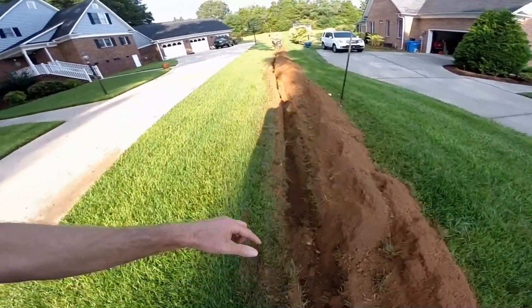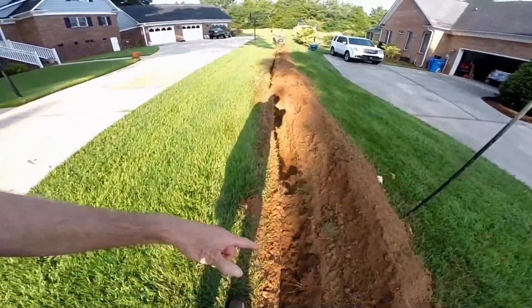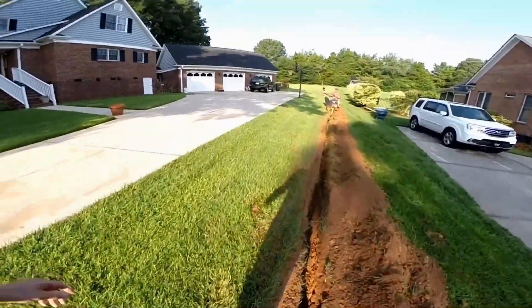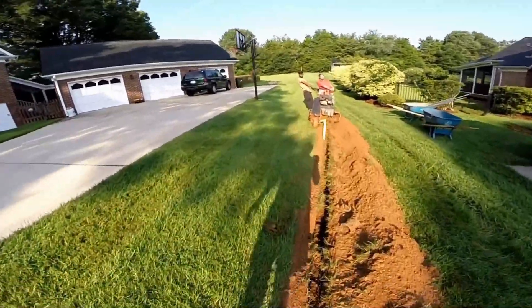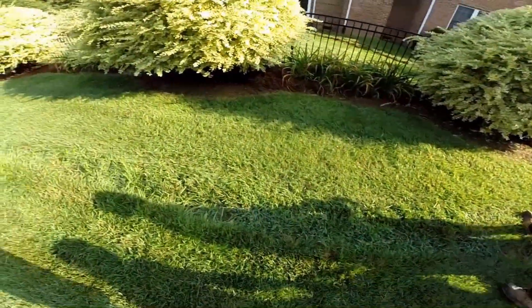You can see where I've already made that line — the trench is deeper and wider. Using the trencher, you could also use a shovel, but it's much easier to use the trencher if you've rented one or own one. Just come back through a second time — a second pass — and pull that trencher to widen your trench. We're going to use a lot of that excess soil to mound it up in the back and force that water into the trench.